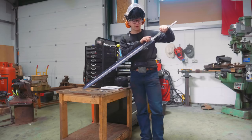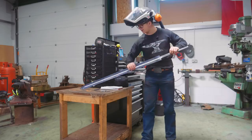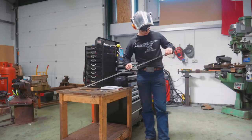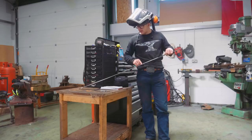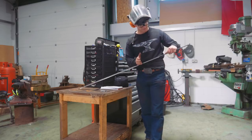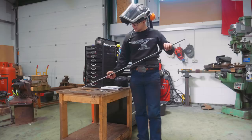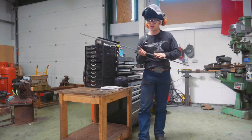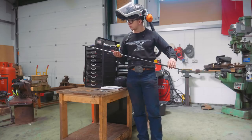So with 3.75 millimeters of thickness up here, it kind of feels like it's about the same the whole way down. Means I got plenty of material to work with. I'm gonna thin that down just a smidge more before we start working on the bevels. And I think I'm in fact gonna be thinning it down freehand now that I've got it set. Being freehand shouldn't be too much of an issue.